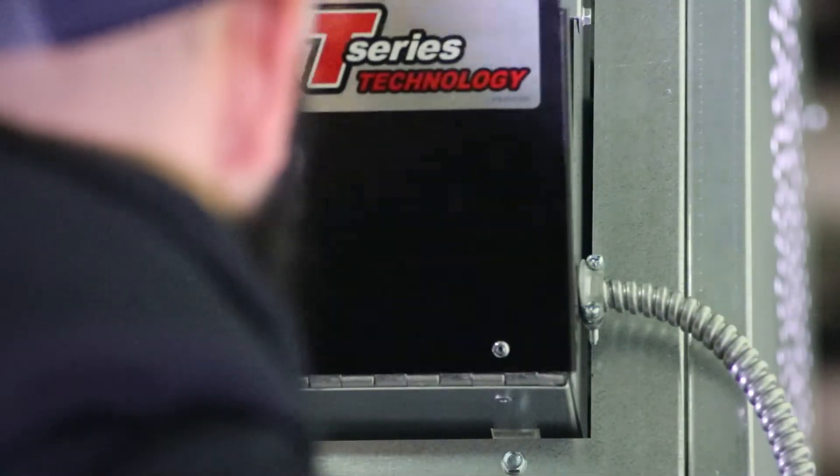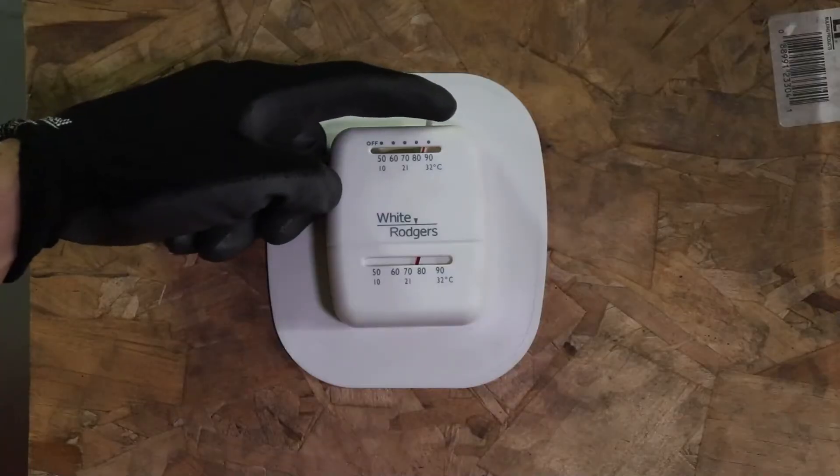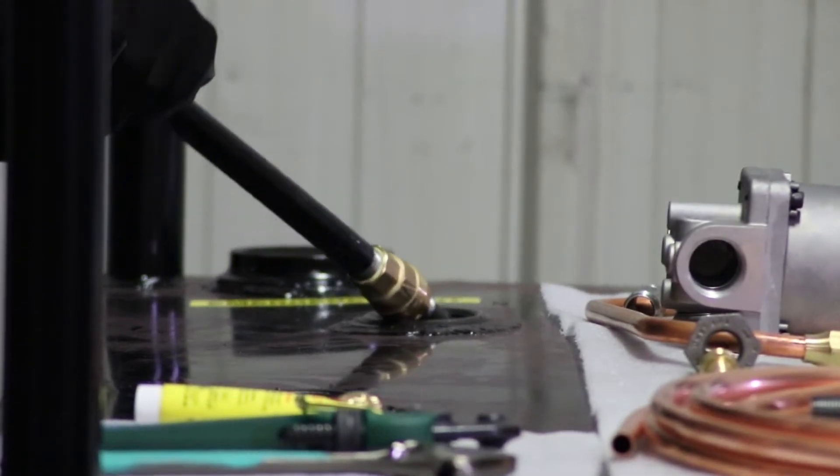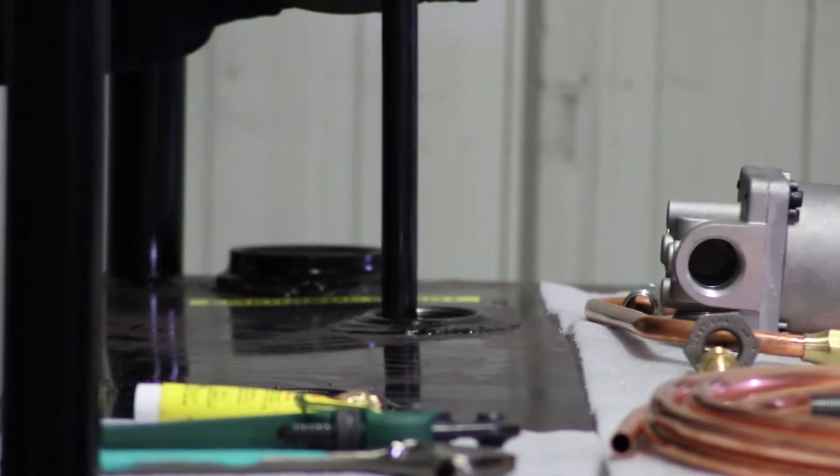At this time, the main electrical service to the unit should be off and the thermostat should be set to its lowest temperature setting. The tank must contain enough approved fuel that the pickup strainer and check valve are fully submerged below the fuel level.